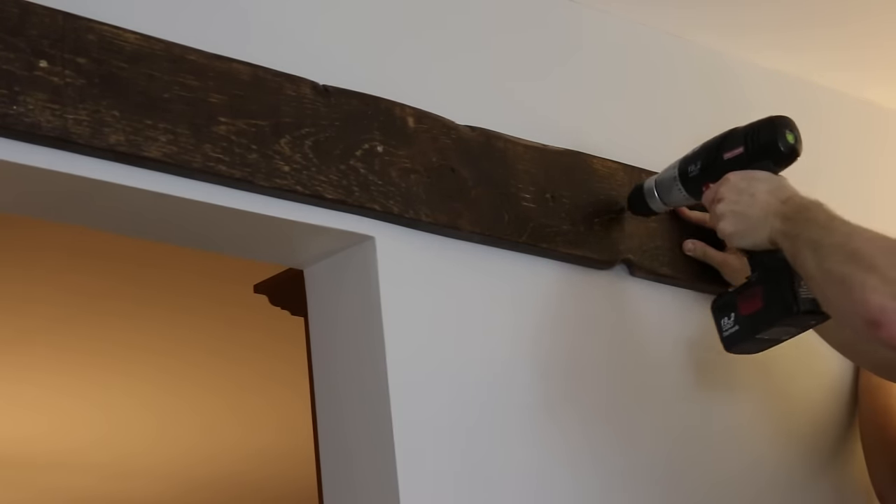The second-to-last step is to install the door stops. These slide right onto the rail and have two bumpers that will keep the casters from sliding off the rails and hurting somebody. Slide it onto the door rail, get it in position, then use the Allen key provided to tighten it up. Repeat that on the other side.